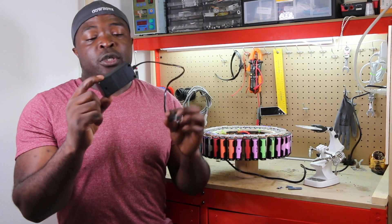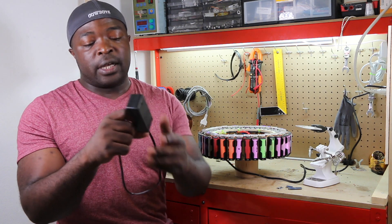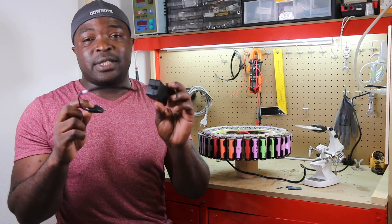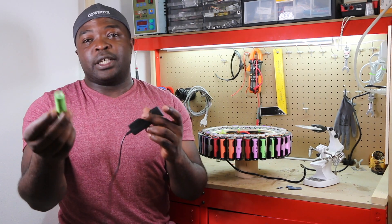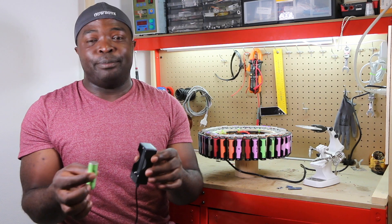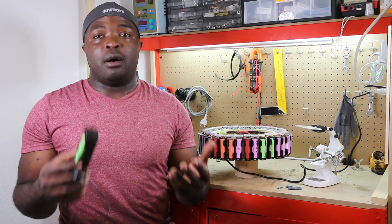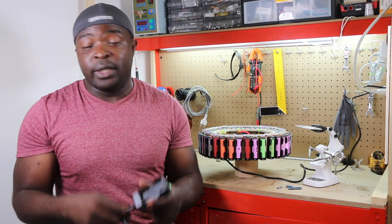When I was in the States I used cell chargers to charge my cells, but these cell chargers are a bad idea for someone who doesn't know what they're doing — they do not have any BMS. Lithium-ion 18650 cells charge up to 4.2V, but if you leave them in a simple charger it will keep charging beyond that, causing heating and potential damage. So these cell chargers are practically dangerous.